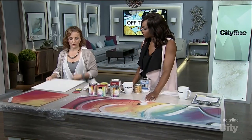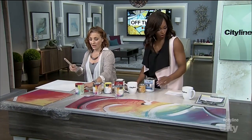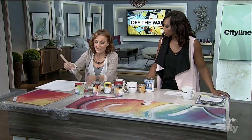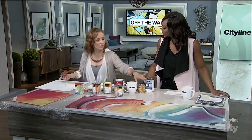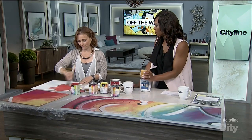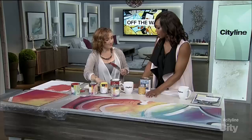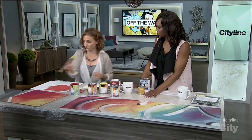I'll show you how to do just a quick mix of colors. I've got Claret Rose here, which is a nice strong red, and Yellow Finch. I really did have these colors lying around — sometimes you might have color samples lying around or just pick some up. I'm using an interior eggshell paint, and then I'm going to top coat it afterwards with acrylic stays clear, which stays clear and will protect it. If it's going to be a piece of furniture in your home, this is an important step — you're going to want to put glasses and plates down on it.